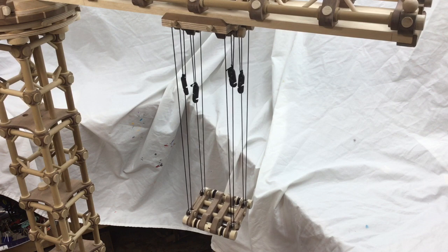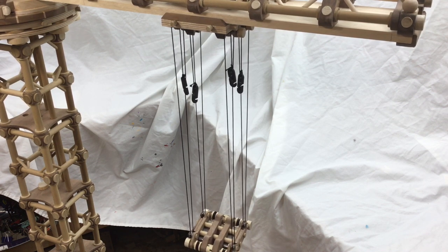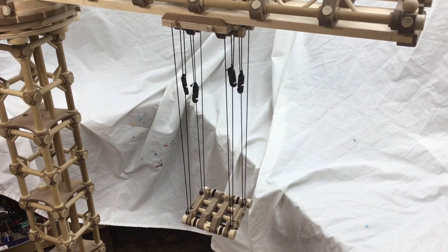Both the front cable carriage and the rear weight carriage are moved by means of a spiral cut rod. The top control ring controls the movement of the cable itself — it's the fastest moving of those three vertical control shafts because the spools that hold the cable are quite small. There are four cables that work in tandem to suspend this rigging cradle. We'll take a closer look at this rigging cradle in a little while.